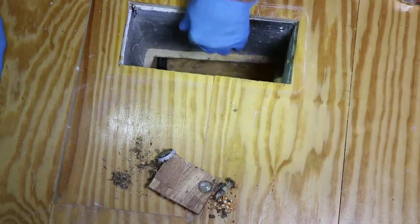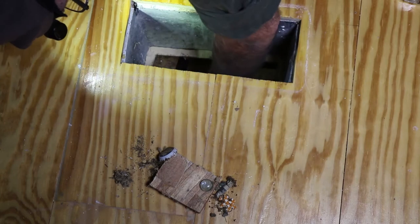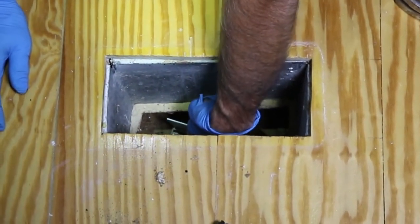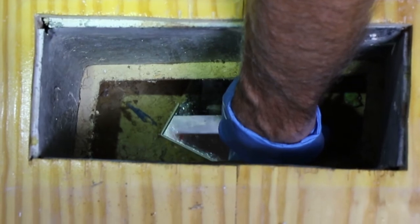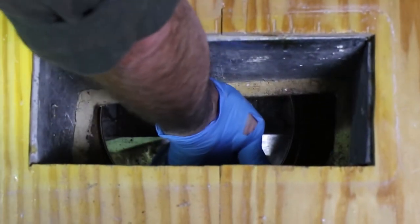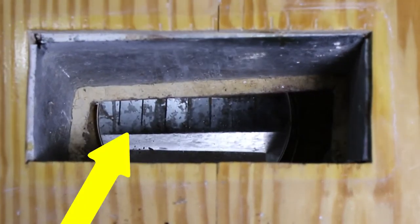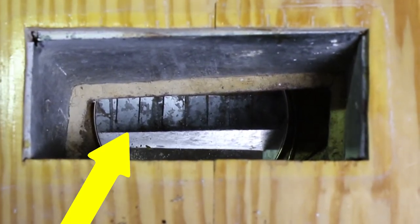Once I've cleaned out that entire trunk line from the area I can reach, I'm going to take a mirror and look at the underside where that riser attaches to the trunk. There's a series of tabs on all four sides that are supposed to be tight to the trunk line. If they're not, that's some of the area you want to seal. Using a larger mirror, you can see the gaps that are there. Those little tabs all have spaces that allow conditioned air — that we're trying to either heat or cool — to flow into the floor cavity. We don't really want the air to go there; we want it to go into the living space.